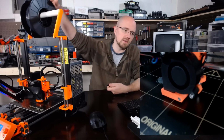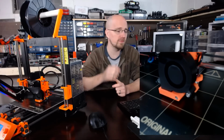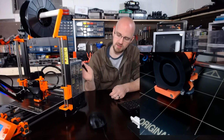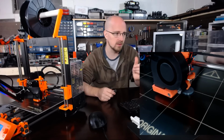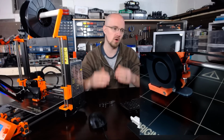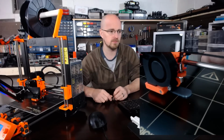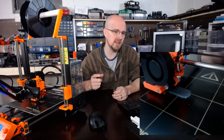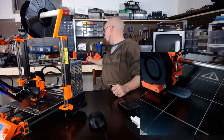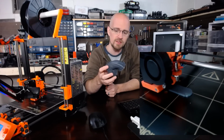This filament is Atomic Filament, gunmetal gray. I can try 205, but when I tried, I was at 210 because that's the default for PLA in most of the slicer settings, and the layers weren't bonding. It was just leaving strings that weren't really connecting to each other. 215 seemed to help a little bit, and then when I went to 220, like I said, that's why it's kind of odd. This print was at 220, and so were the smaller ones, and those are perfect.